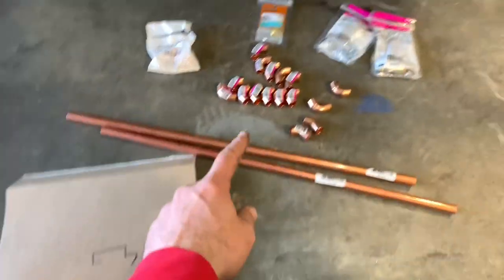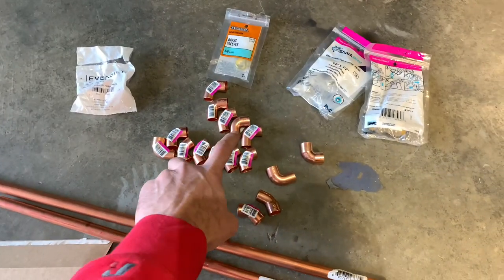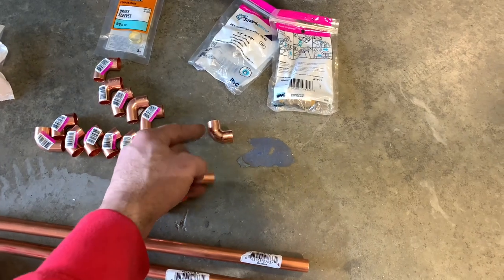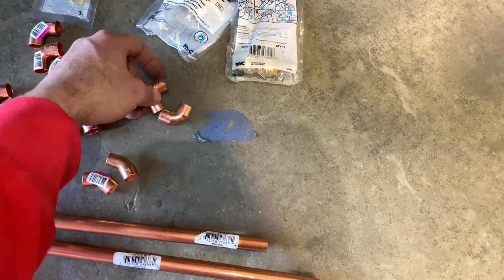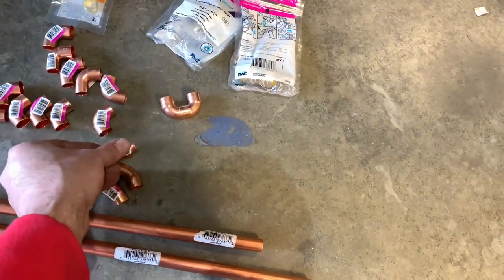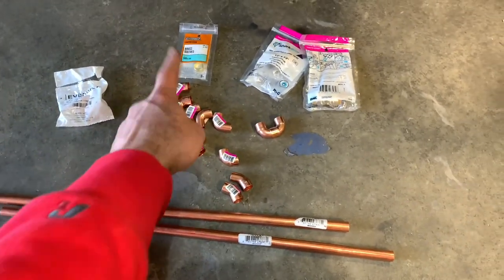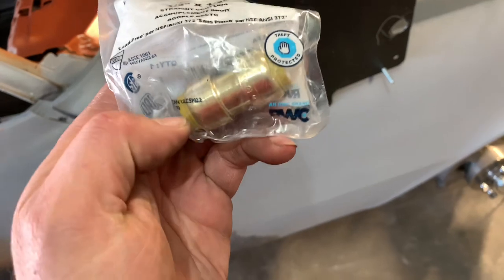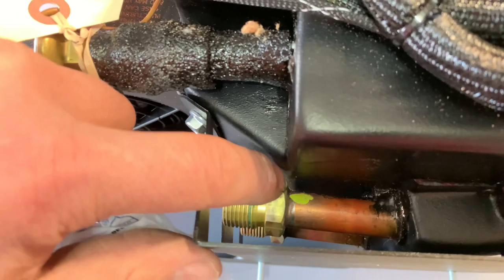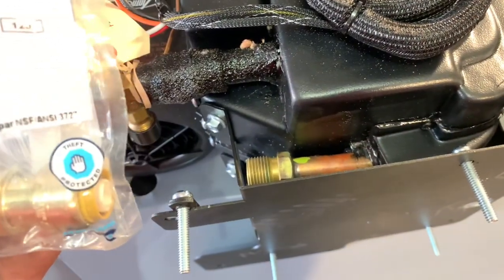We made it back from the getting place. We were able to find these parts. A couple pieces of half-inch tubing — that's pretty standard stuff. We've got standard elbows and also some street elbows, depending on how tight I need it to go. The difference between a street elbow and a standard elbow: large and large versus large and small — this one actually slides into this one. I can make a super tight radius if I need to. Sitting right here is about $50 worth of copper and brass. I've also got a half-inch shark bite style fitting — it's serviceable, you can push the little tab and it'll actually release it.